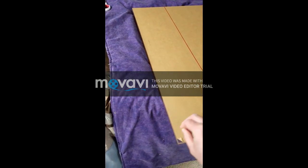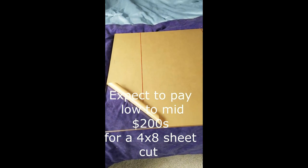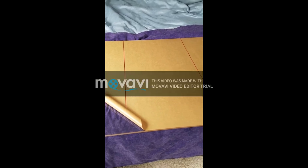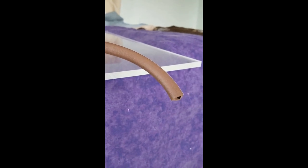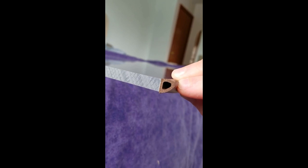You can just pull the paper back to expose the acrylic. Note that when buying, you'll likely have to cut it out of a four-by-eight sheet. I found these relatively inexpensive — my total cost was roughly $80 to $100 a window. The next part is to actually put the weather stripping on the sides of the acrylic sheet. The nice part of this tubing is the shape — the bottom portion will push into the window and the flat portion will stick out.